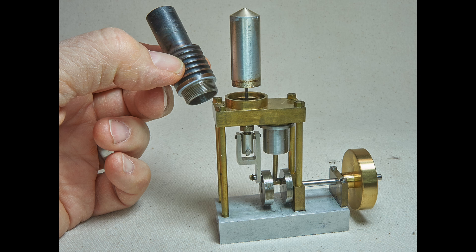The displacer cylinder was machined from three-quarter inch diameter solid steel, the free-machining variety, threaded 40 TPI to screw into the brass standard. The displacer is about a half inch in diameter, hollow aluminum, and its stroke is also a half inch. The power piston is about three-eighths inch diameter with the same stroke. Its cylinder is steel, lapped to a nice fine internal finish, and the piston is made of brass, which has held up very well over all these years.